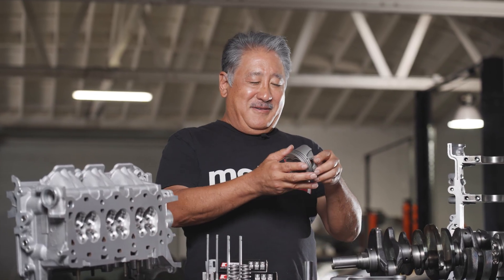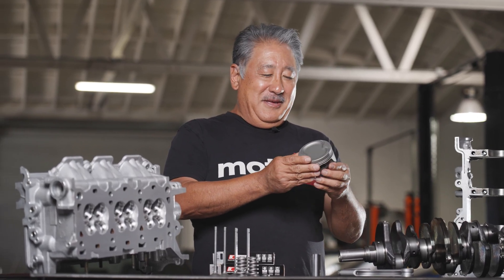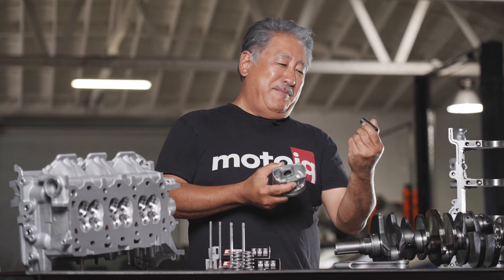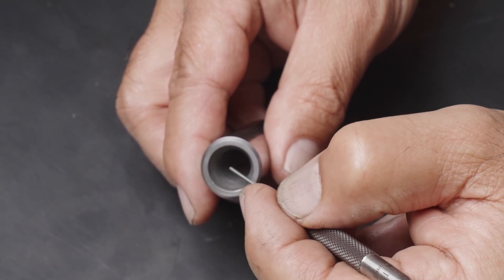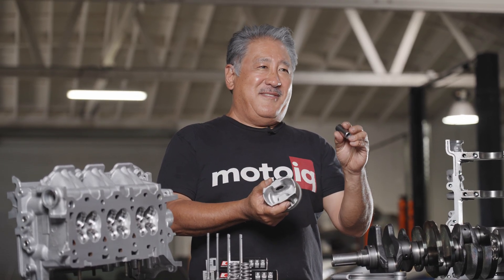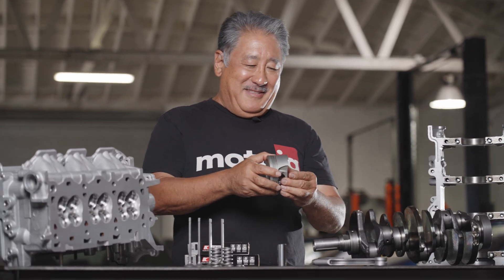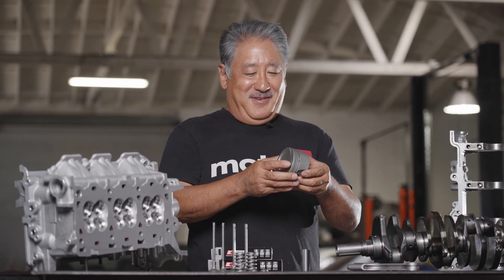The pistons are very special too. These are forged pistons — we use 2618 alloy, which is really tough. It's a strut type piston so it's lightweight, stiff, and strong, with a generous pin boss. We use a piston pin that is fairly thick-wall with a slight taper. A lot of people make mistakes running a thin-wall tool steel pin on a turbo engine, but we use a slightly heavier thicker-wall pin, which reduces the likelihood of flex. When the pin flexes it can gall inside the pin boss or actually grab and spin the small end bearing out of the rod.